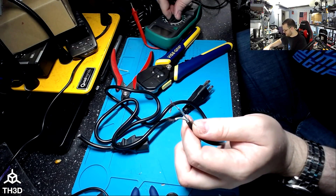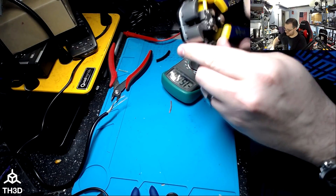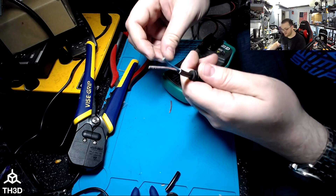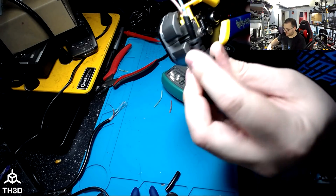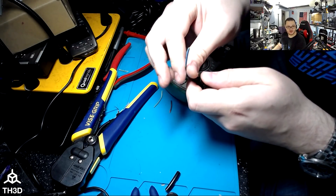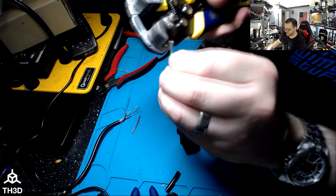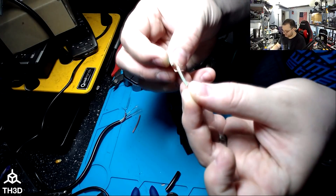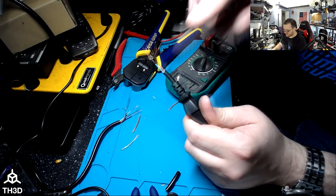This doesn't work, so let's find where the fault occurred — whether it's in the plug or the connector that goes to your printer. We're getting a reading at the plug end, so let me strip the other end. There's no wire in here — there's actually no wire in the C13 connector end at all. That would be why this cable doesn't work correctly. The wire they used was so short that I pulled off more insulation than there was actual wire, and that's our point of failure.